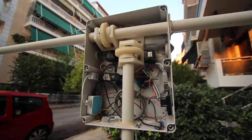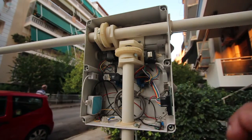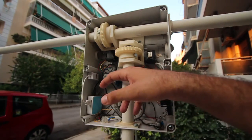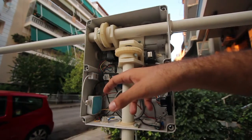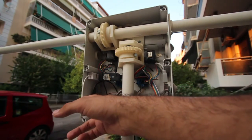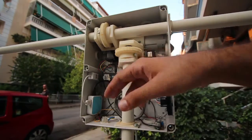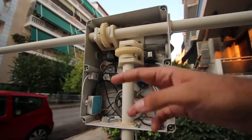These are China-made DVB devices initially purposed for TV reception, but through the proper driver installation you can actually use them to track pretty much all the frequencies we need — from all the way down to something like 10 or 20 MHz all the way up to almost 2 GHz. We have the UHF and VHF in a USB hub, and reception is done using RTL-FM. Through RTL-TCP we can transfer this information back to a server, laptop, or whatever, so we can do the decoding there instead of locally — those are two options.